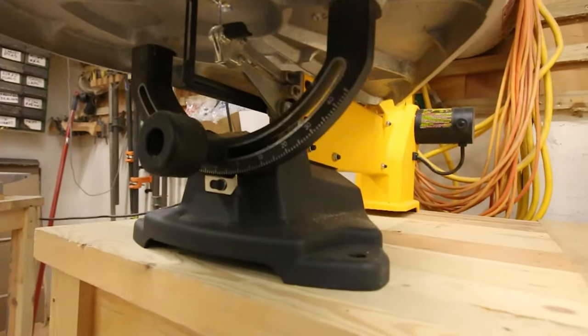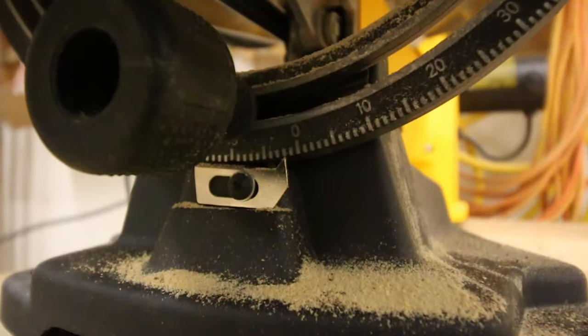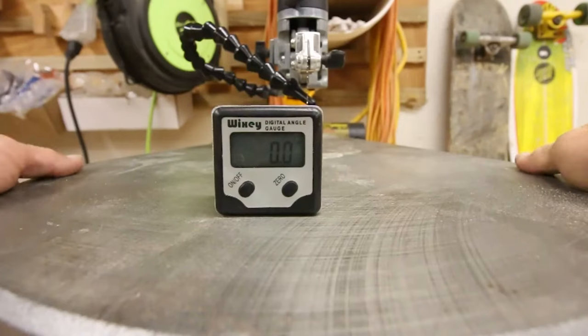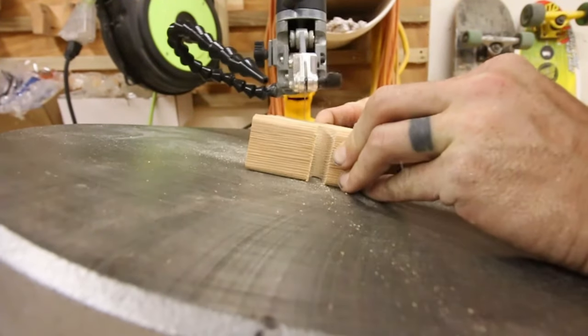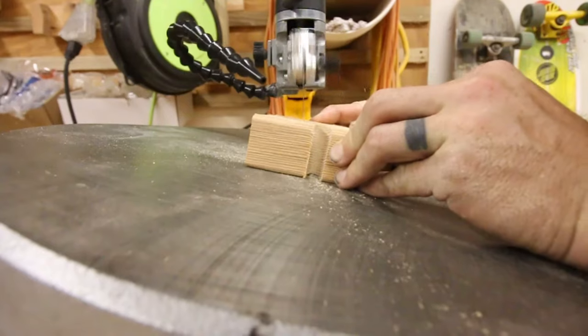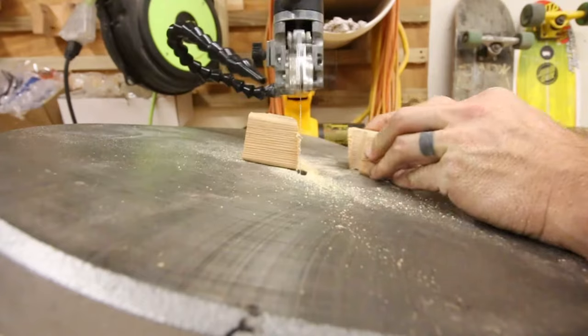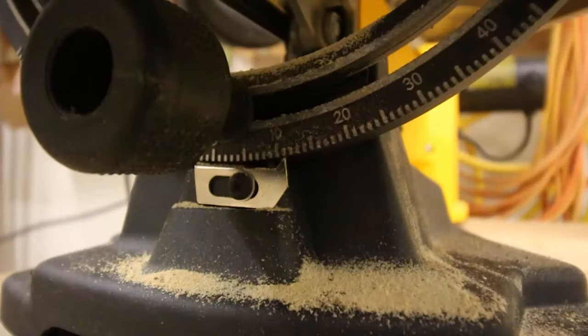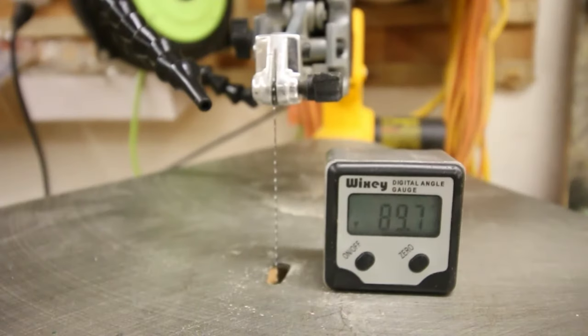Another feature I really like about this scroll saw is how easy it is to change your angle. It has an angle gauge on the front — all you have to do is unscrew the knob and you can turn it to just a little bit over 45 degrees. No matter what angle you set it to, it always feels incredibly rigid and secure, so there's really no worry about it moving while you're cutting. Keep in mind this does reduce your capacity. Although the angle gauge gives a very accurate measurement, I also like to use digital angle finders to really dial in my settings — I'll put a link in the description because it's a must-have tool for any wood shop.